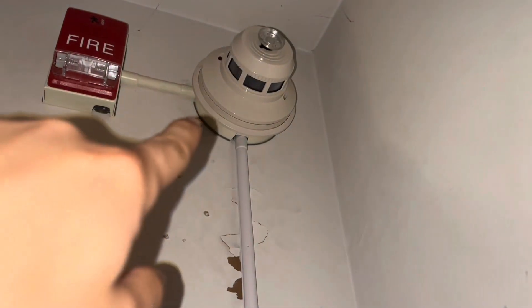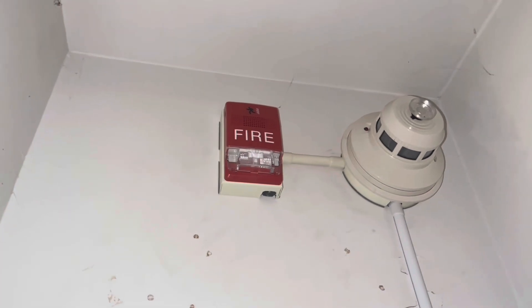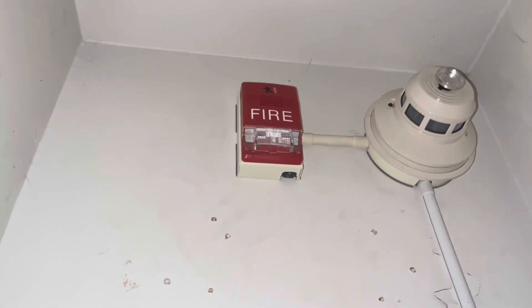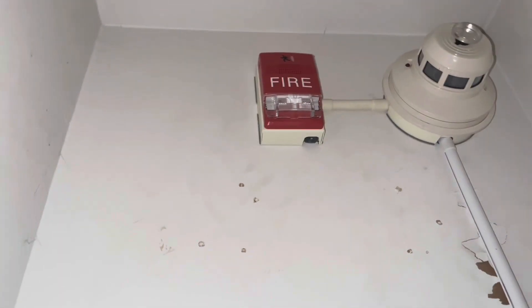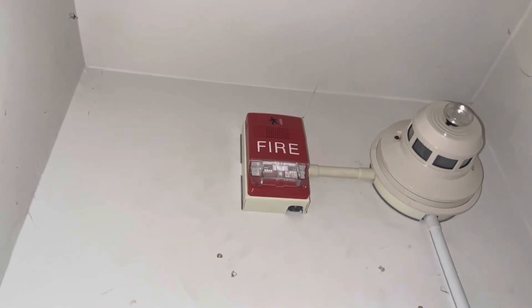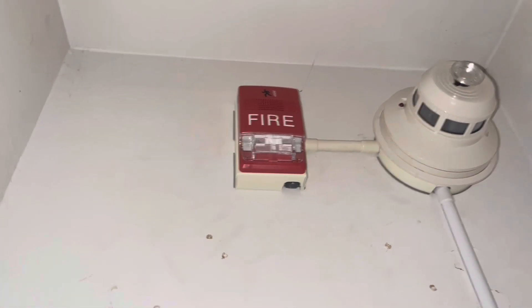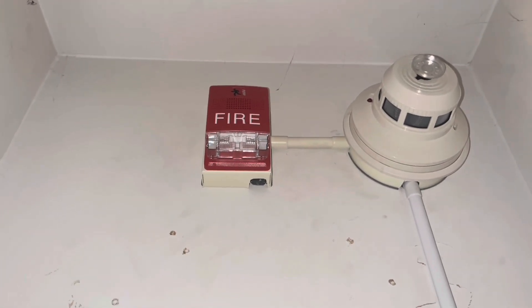Following this wire mold all the way up close to the ceiling — I know the wall's screwed up — we have a System Sensor 2424TH heat and smoke detector, right next to an Edwards Genesis G1RF-HDVM horn strobe. The reason I put a horn strobe in here is because I wanted one. I know it's probably way too extreme for this small room, but the sound goes out in my room too. I already have another horn on the system, so I don't think this will stay up here. It might get taken down and replaced with a G1RF-VM remote strobe. This is set on 15 candela.